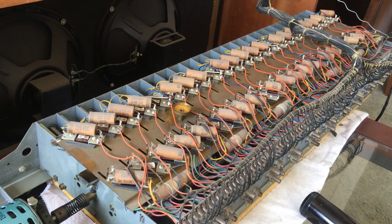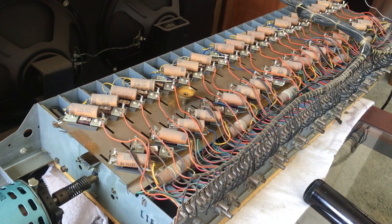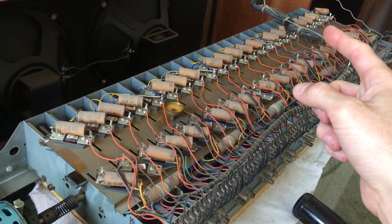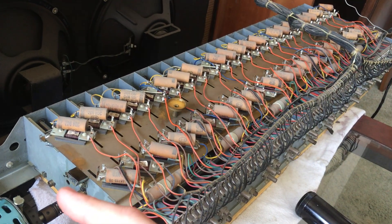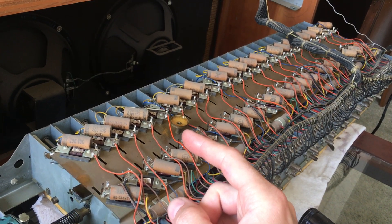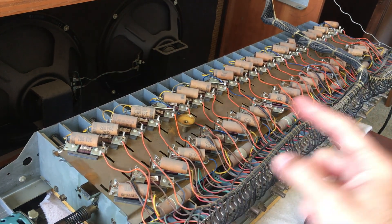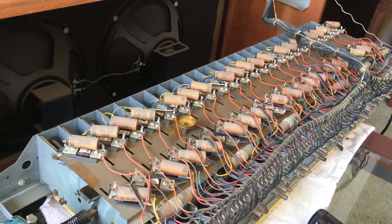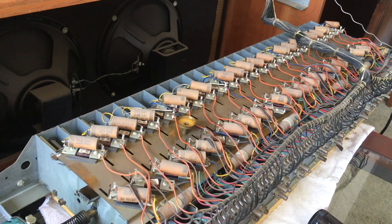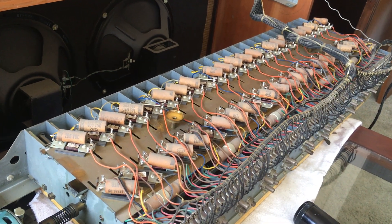So if you have a really noisy tone generator, I suggest you just take it out, flip it upside down, add some oil precisely where it's needed, and then top these off because you know the felt is dry. Yesterday I filled these cups four times and also added oil on the side of this trough a whole bunch. About 30 minutes later I flipped it upside down and nothing leaked out — it all soaked in. So I know it was completely dry. I'm just adding a little bit more now.